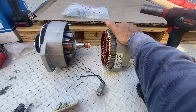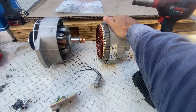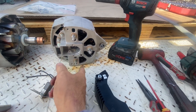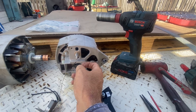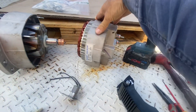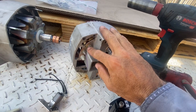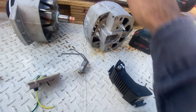This one in particular is going to be used in a boat for a 24 volt system, running off an Arco Zeus external regulator. I have used Wakespeed and Balmar regulators with these — they've all worked fairly well. For temperature sensing, you can take from there or there. If you take from the positive you've got to fuse it, so generally you take your temperature sensing from the negative post or from one of these posts, which is off the back end of the windings.